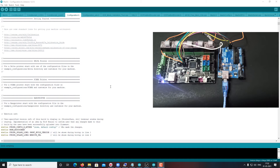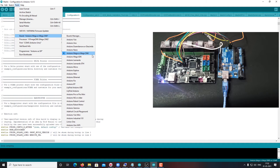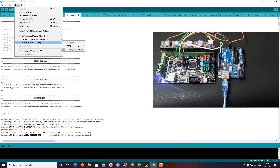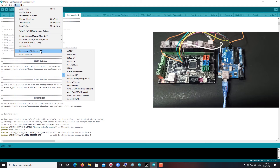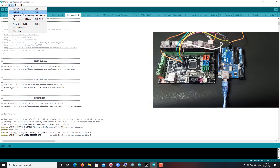I need to upload this firmware. Just check once: the board should be Arduino Mega because the MKS General has the same architecture as Arduino Mega. Select the programmer, then go to Sketch — don't use the normal upload option. You just click on Upload Using Programmer.